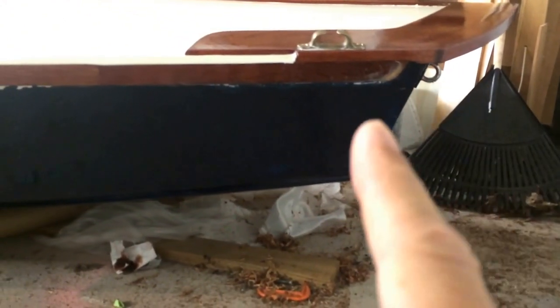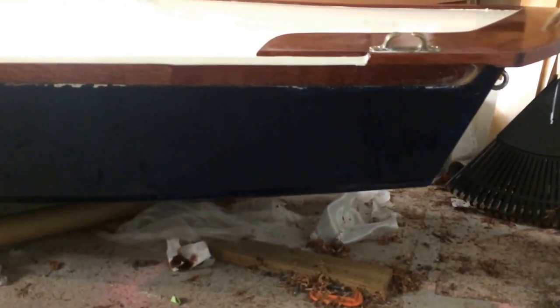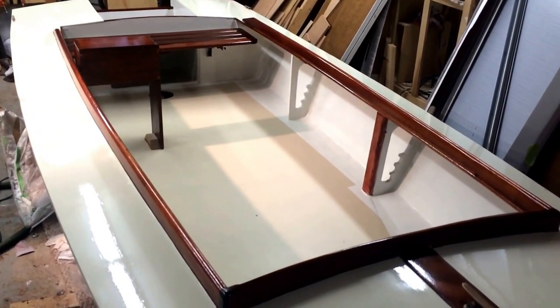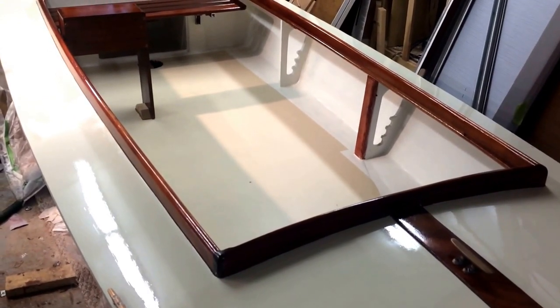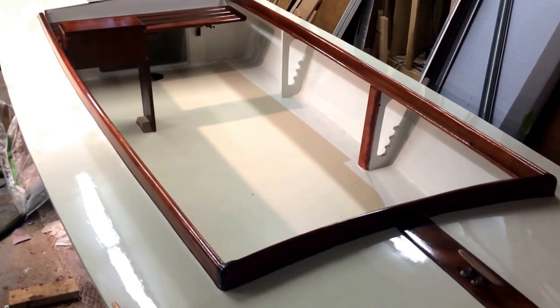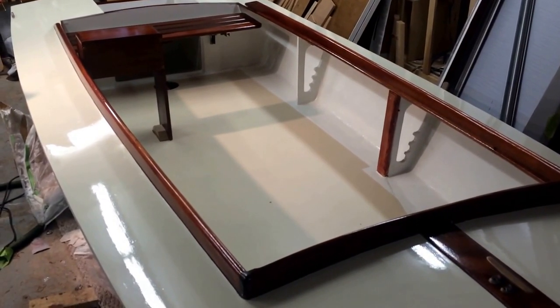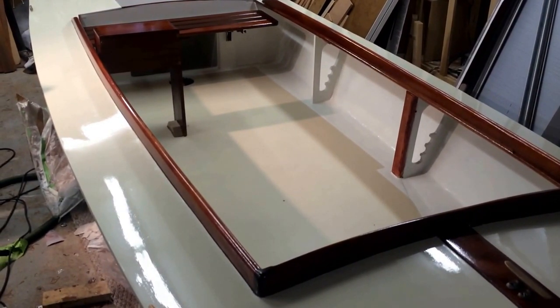The Garvey-style boat has a flat front on the bow — you can see the flat profile there. There's still some work to be done up here under the sheer clamp where some epoxy pulled away a little bit of the paint — I've got to clean that up with some sanding. But all in all, thus far it's turned out pretty nicely in my personal opinion. I'm happy with the paint and I did go to some pains trying to do bright finishing on top, and learned a lesson there.